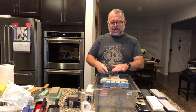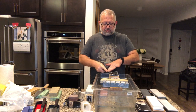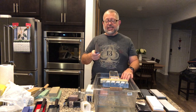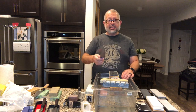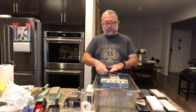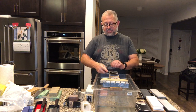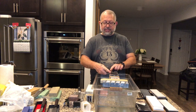When I do this, I don't stop all the time and count. Now this knife has a big bolster on it. I can't stand it, and I know a lot of you can't either, but if we're sharpening knives for other people, we get a bolster. I'm able to get to the corner of that still doing this. You might go completely across, and then when we go edge leading, you can miss the bolster as well. But I'm able to get the knife right out of the bolster.